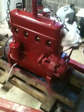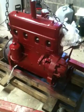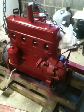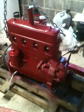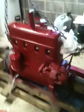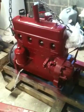Now a lot of you die-hard Farmall guys might be wondering how I used a 140 crank in a 130 block because they're a little bit different. What we did is we cut the threaded part off of the 140, and some of you might think that was a bad idea, but I had a parts tractor, I was using these parts, I was having a hard time finding them, and it worked. We put the Super A pulley on there and were able to press it on the crank after cutting that threaded part off, and it worked out real good.